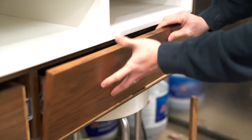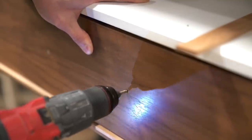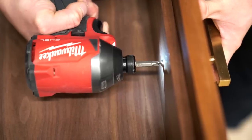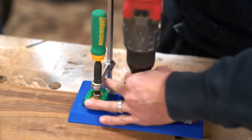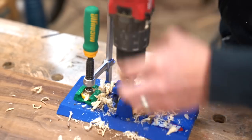Okay, let's attach the front to the drawer box. I'm using some spacers to set the position and then use the holes I drilled previously as a guide. Then just attach them with the screws for the handles and some additional ones countersunk into the back for added strength. And then I'm ready to mount some door hinges. To do this, I will use this jig to keep things easy.